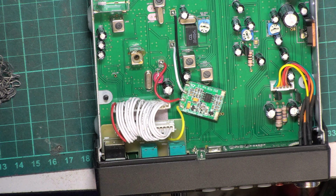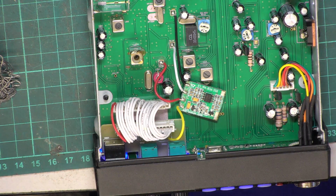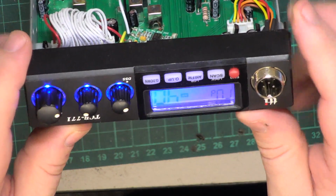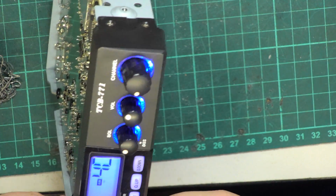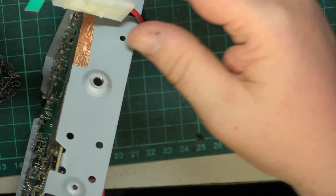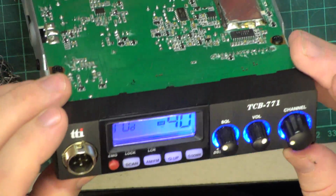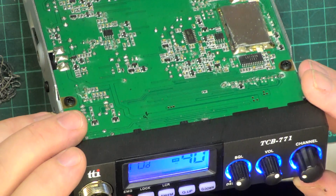Okay, well, I had success. We happen to have got a TTI power lead in stock. So we'll switch on the power supply and we'll see what happens. Power supply is at 13.8 volts. The radio is drawing 180 milliamps. And wow, it's on Romania. Mind you, power lead's a bit short to go to our power supply. So I wonder how we change this.